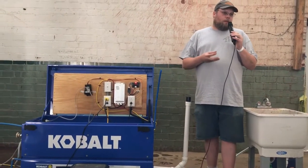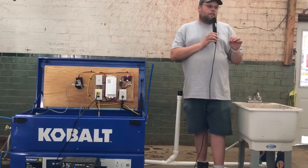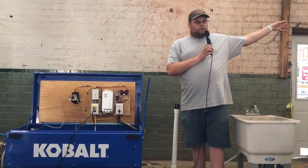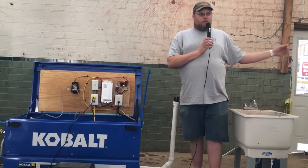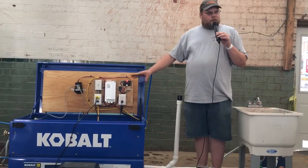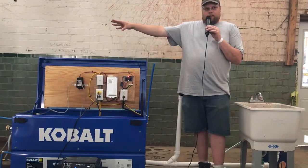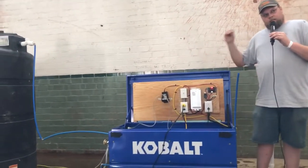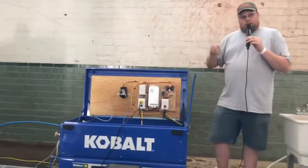We've pretty well narrowed it down to where we have three main system types. And at this jam, we actually have all three system types in the building. The Acunas' house right out the door here has our interior pump system with our exterior tank system. If you go and look at it, it has all the pumps and all the pre-screening filters and everything in their tongue box with their solar. And on their actual 500-gallon tank, it has the vacuum pulling the ozonated air through, and basically this dispersion system down in the bottom of the tank, so it ozonates the tank.